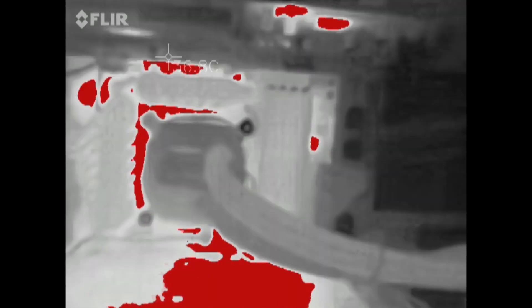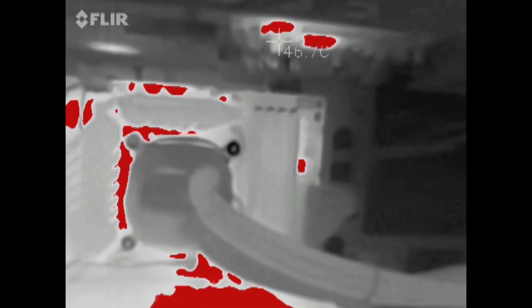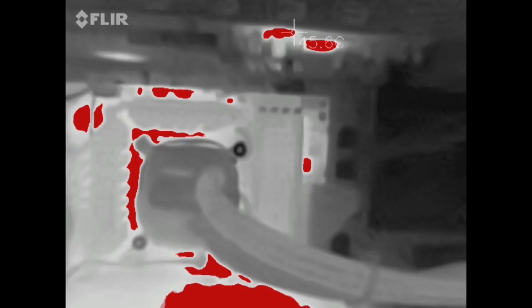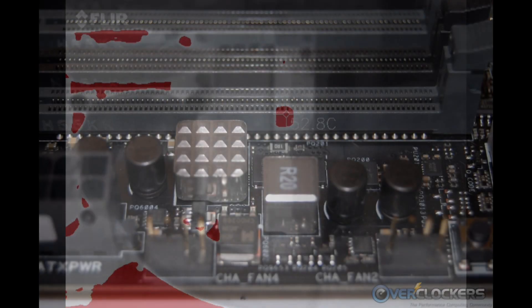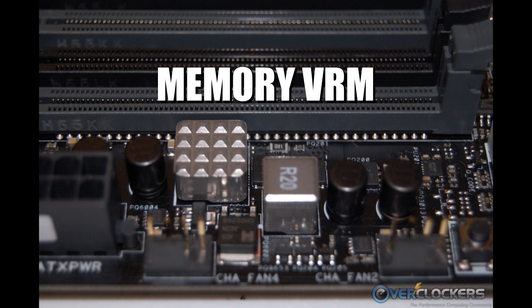There are a few caps up here — nothing too bad. Hopefully this will help identify some of the hotter spots on the motherboard. Up on top there is actually the board used to power the LCD for my Snow Blind mod, which you can check out in the card in the upper right corner. We've got a spot right here — about 53, 54 degrees. There's an inductor right there that is probably related to the processor, maybe providing some power. We're going to measure right here — looks like we're getting 78. That's interesting. What is that?